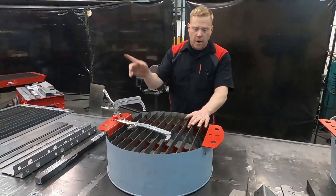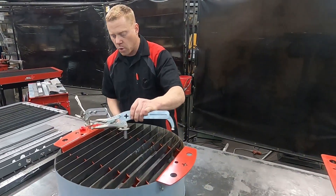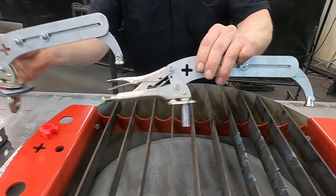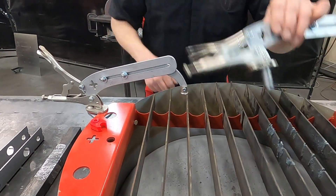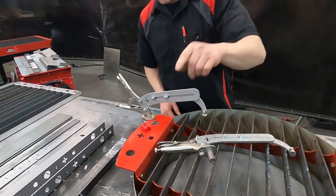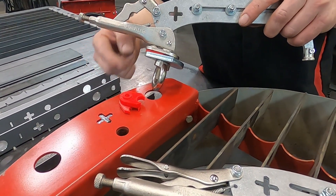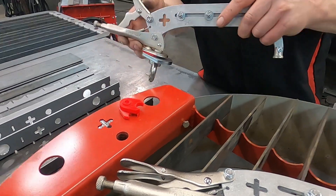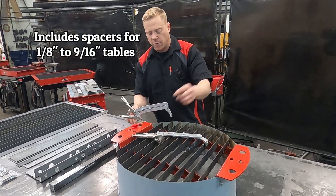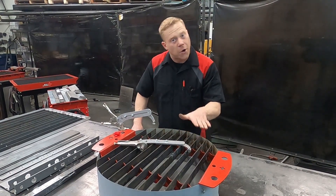This is basically the new version of that older style, still using a 55 gallon drum. There are two clamp styles: edge clamp and post. The edge clamp just clamps right over the edge of your table, and the post style drops into your common 5/8 fixture tables and clamps just fine. The edge clamp also comes with two additional spacers — you can remove the 1/8-inch spacer, and use a combination of all three spacers to make the edge clamp work on your existing fab table too. Both new clamp styles can work on your existing fab table and work really well on our plasma tables as well.